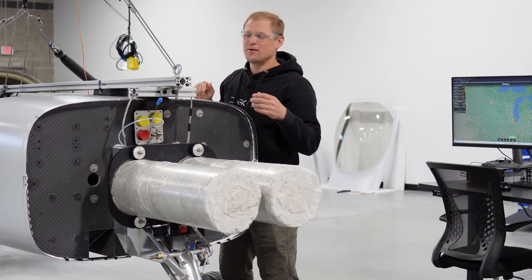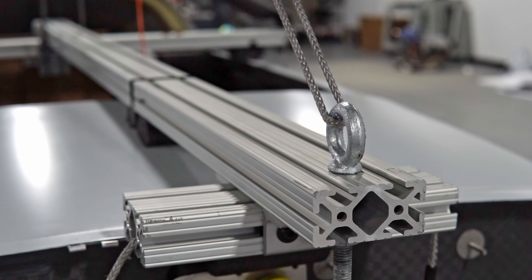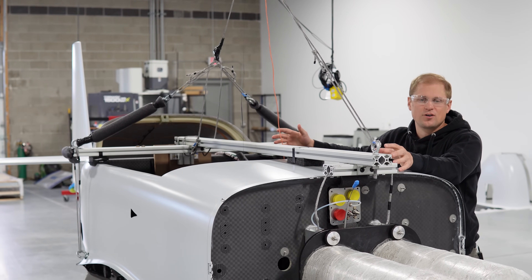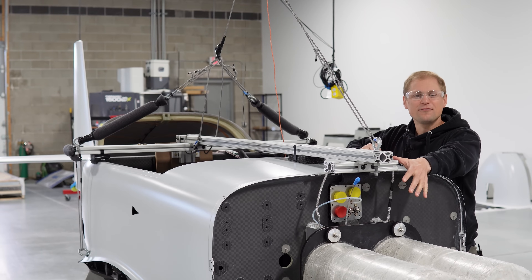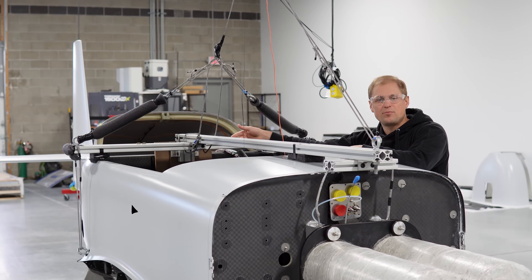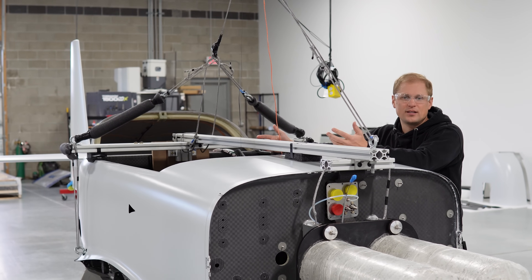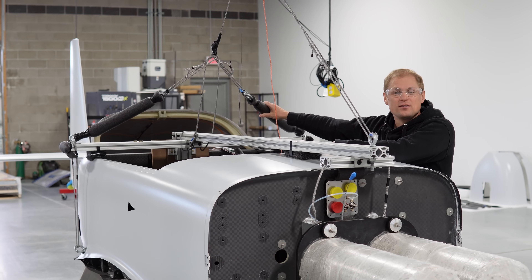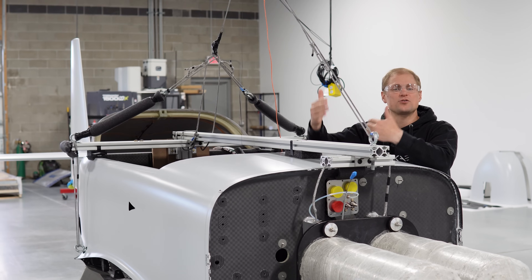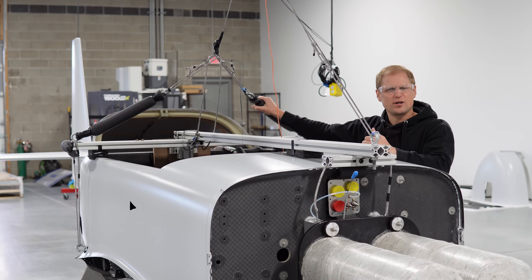Working our way back from the firewall, we have our lifting frame made out of extruded T-slot aluminum with Dyneema cord. This is set up so we can pick the airplane up in a repeatable manner from specific locations that are strong enough to actually lift from. In front, we're lifting from the engine mount and firewall. In back, we're lifting from the trunnion pins, which is where the main landing gear attaches — a pretty solid piece of hardware. At the back of the frame we have two turnbuckles that allow us to adjust the rig to make sure the airplane is level in roll, so both main landing gear impact the ground at the same time.